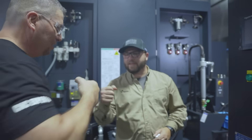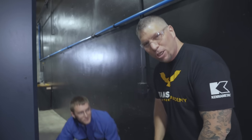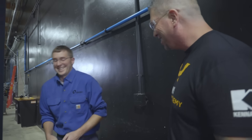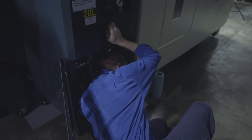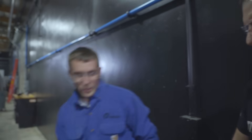Over here we have Dan, another service technician from Makino who also solves problems in the office — he came out to California to help us. He's actually putting in a new computer system. They're adding the MH Max system, which includes temperature probes, pressure sensors, and load meters to do predictive analysis for machine maintenance — monitoring spindle health, hydraulic system, cooling system flow and temperatures — so they can inform us of any maintenance issues before we have downtime.